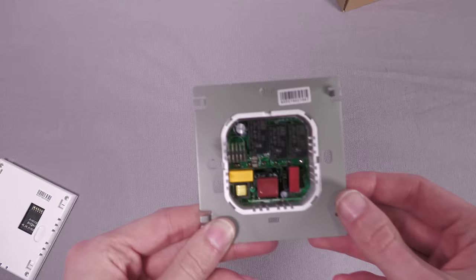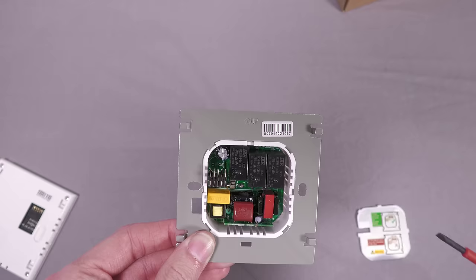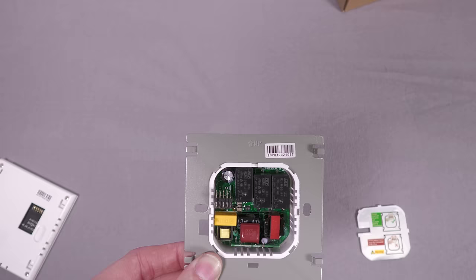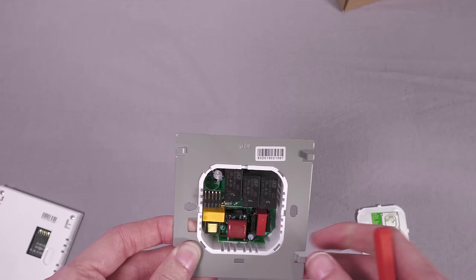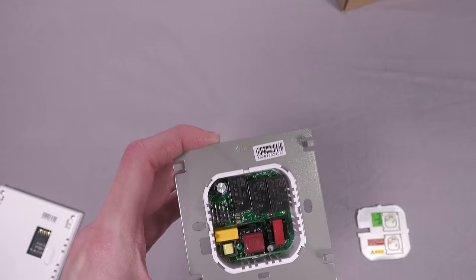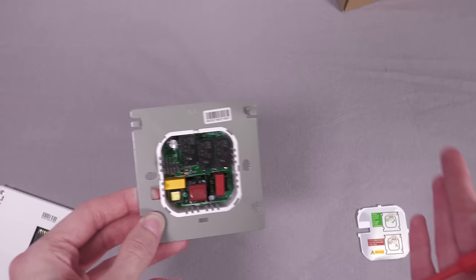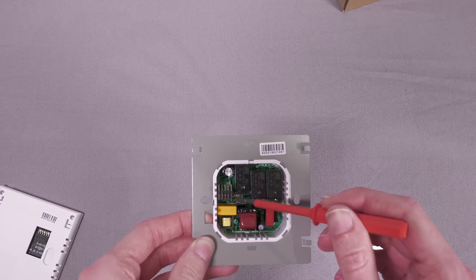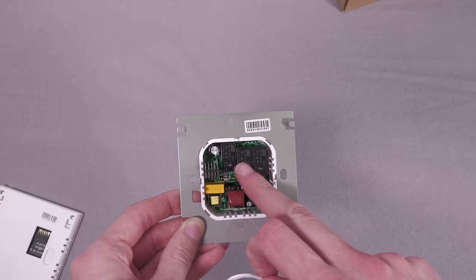It was just making intermittent contact through the edge of the hole, which is obviously not good. I probably should have returned it, but I had a soldering iron handy, took it apart, soldered those joints, and that fixed it. I'm not an electronics expert but the design looks safe enough — I just want to warn you that at least with mine, one unit was missing solder joints. I'd definitely recommend checking yours, because if you're running a higher current light load through a dodgy joint it could heat up, spark, and cause a fire.